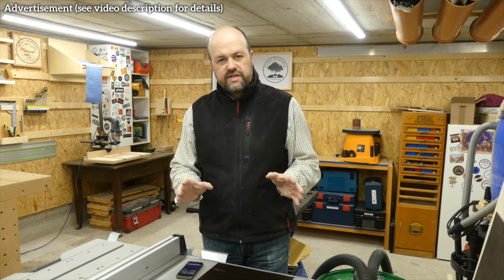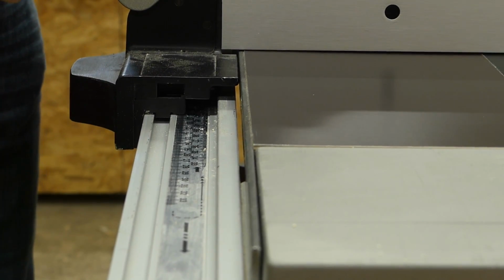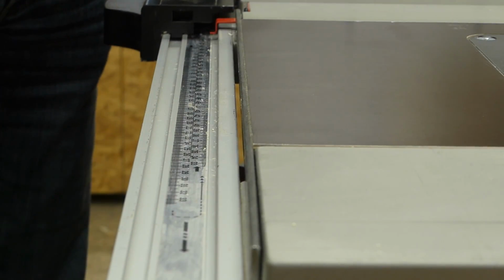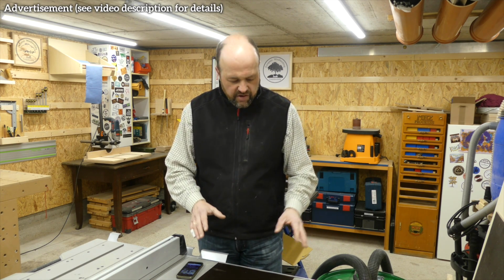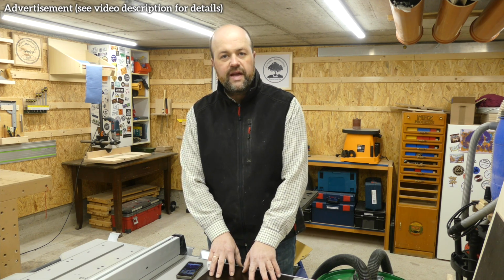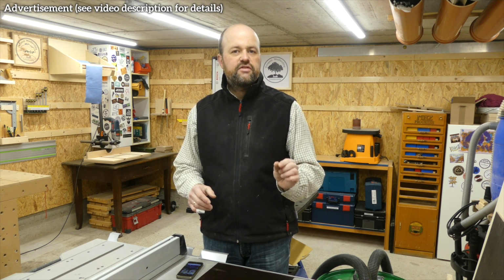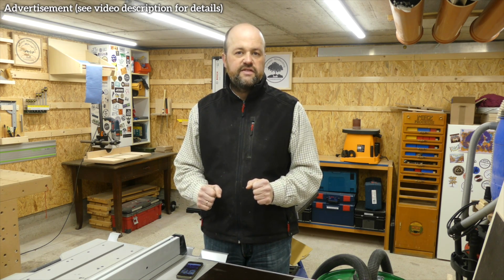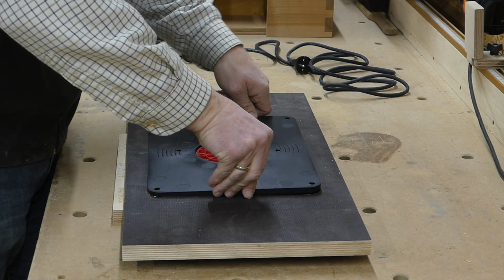But if you have slight inaccuracies, which I always have, then the steel bar just sticks out a little too much, and then the fence will hook up to it and not slide as easily as you would want it to be. So I had to file down the steel bars in some places a little bit, because through the screwing of the steel bars to the plate here, they bent ever so slightly, and that was enough to make the fence of the table saw stick and not slide easily past the metal bars. So I'd recommend use steel bars of 2 millimeter thickness, so you have that extra millimeter of wiggle room for inaccuracies like these.